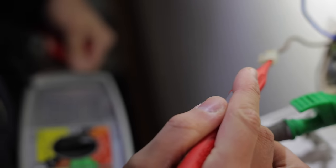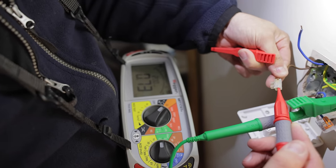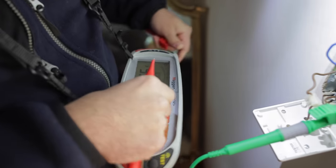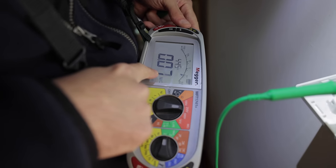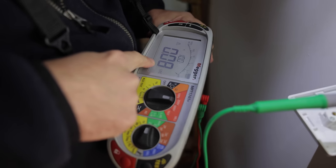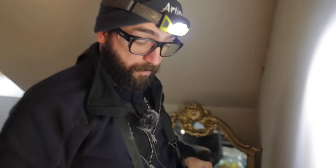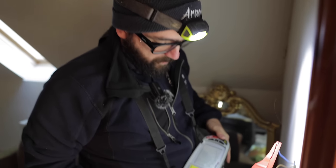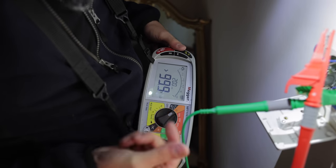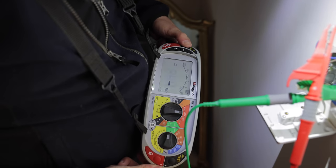This is the outgoing leg up to those lights. You can see we've still got a dead short. This is on low ohm. But if I put that on insulation resistance now, let's put a croc clip on it just to show you. It's fluctuating around, but that's a low reading, but remember this is megohms. So that's 8,000 ohms, that's the reading it's getting there. It won't show up on low ohm. It's just to show you the difference between the two tests.